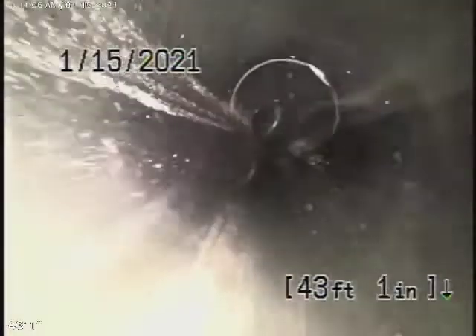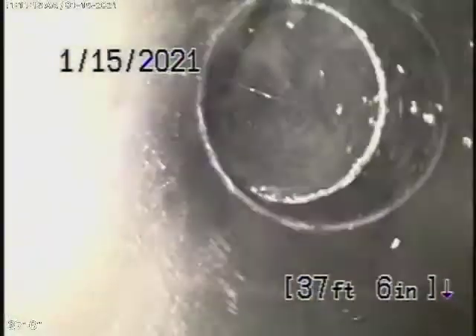That all looks pretty good. We're coming back to an ABS plastic pipe in the backyard of the property. Around here we start getting into a little bit of water in the line, which is a little flat. There is probably about an inch or so of standing water in the line for a good 8 to 10 feet. Then it comes out of the water and back to ABS plastic, which is all in good condition. It's just about 8 feet of pipe with a little bit of standing water.